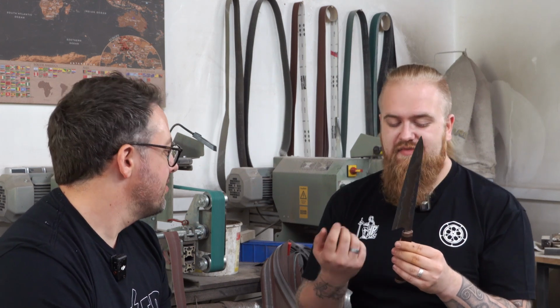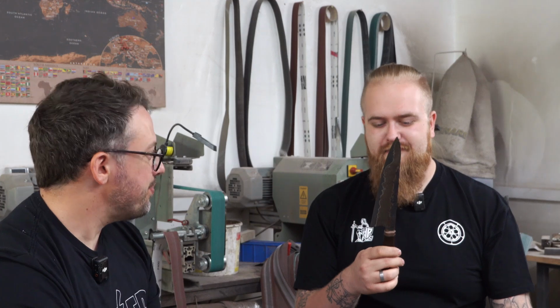It's temperamental. As I said before, you have this small window of forgeability on copper. And if you go over that window of temperature, it's done. And this can happen any time of the work process. It's not like classic Damascus, where you start forging and you have a delamination in the beginning. Oh no, it didn't come together, I've been too low, okay, let's throw it away. With this piece, you have it until the very last second that you work on it. You could have your brain shut off for a few seconds and suddenly you have a puddle of copper in your forge. As it happened last week.